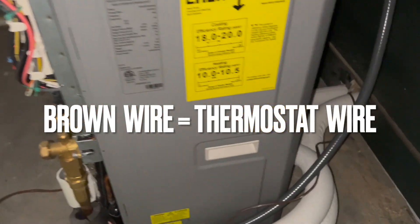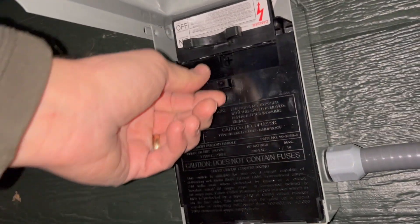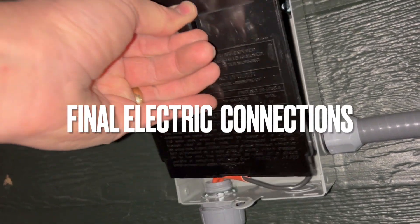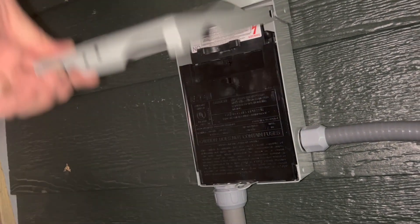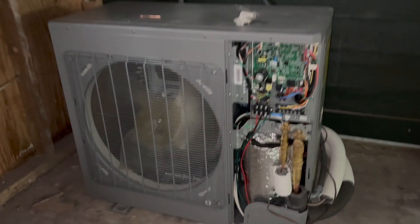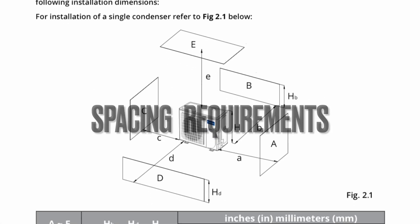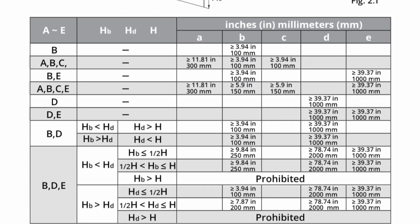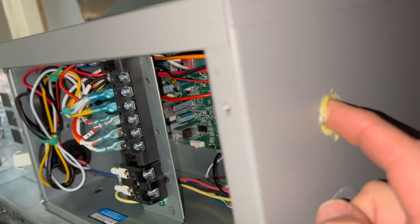Here's a look at the final electrical connections. Be sure and look at the reference manual for the exact placement — you have limits on how close walls and ceilings can be to your condenser unit, so be sure and check those in the manual. We took out the knockouts here; this one is going to be power and that one is going to be thermostat.